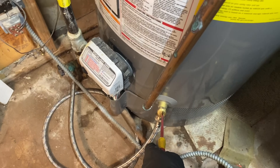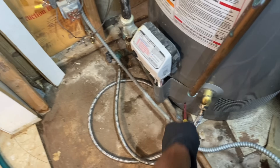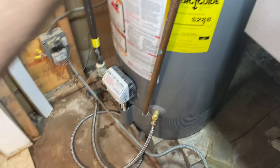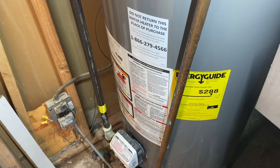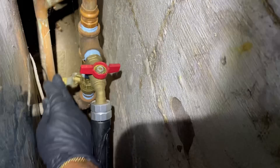I'm going to open this up first — you need a flat screwdriver. When you use a hose and it leaks, it's not tight enough or the washer's missing. The hose is at the same pressure as what's in the tank — say 50 to 60 psi. On this other side you have a ball valve, pulling it all the way out. Now I'm going to open that one, so the hose is connected to the open drain but nothing's flowing yet. Then I'm going to close this to isolate this side of the pipe, and now we're going to open this up.